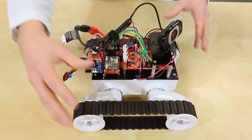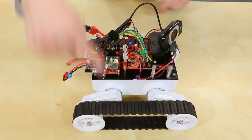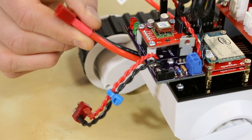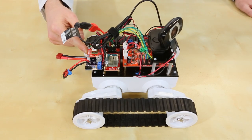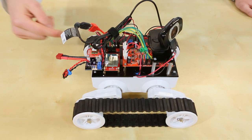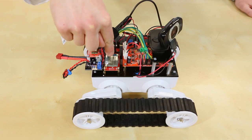The base of the robot is the Rover 5 chassis, and this is a four-wheel drive chassis that gives us tank drive with these treads. Powering it is a large LiPo battery stored within the chassis. This connects up to a custom power board, and that powers both the Rover itself, as well as a large DC-DC converter, which sends power to the Intel Edison.